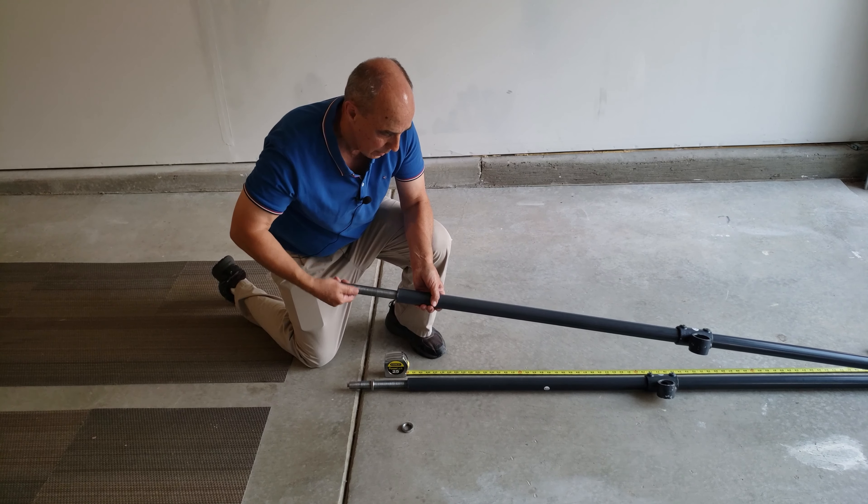Stick the screwdriver through and start to tighten it. We also have the earth magnet which doubles as a level — it goes right on the steel pole — and you can check plumb this way and that way. Like I said, if you put it in at the top and give it a moment it'll plumb itself. So now we tighten it up. This screwdriver fits the hole just about perfectly. Remember you really want to tighten this — it can handle it because it's all steel: the top plate, the pole, the stem, the base plate — everything is steel.